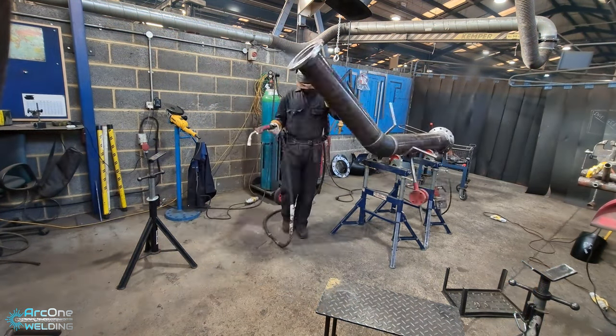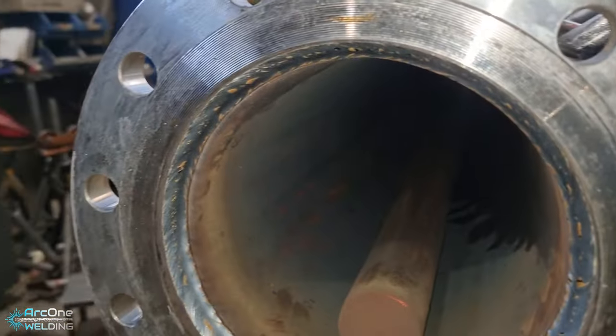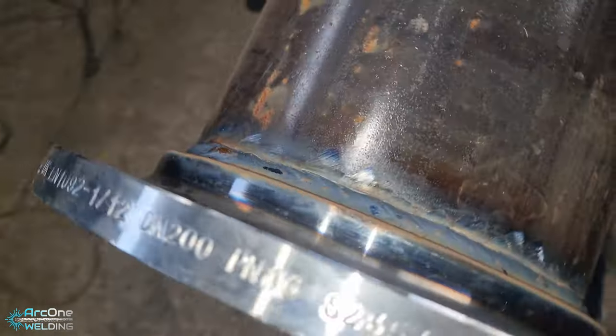The video is coming to an end. Just doing the inside flange weld — the outside flange I didn't quite record properly. The inside flange is done at 250 to 260 amps, pushing it. Some people drag it; you can drag with this type of MIG and it still comes out nice, but I push it and I think it looks a lot cleaner. The outside you can't really see, but the next clip will be the reveal of this pipe.